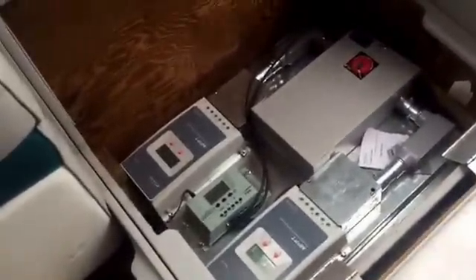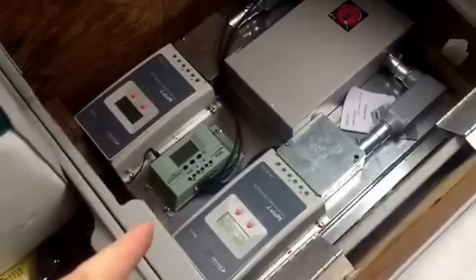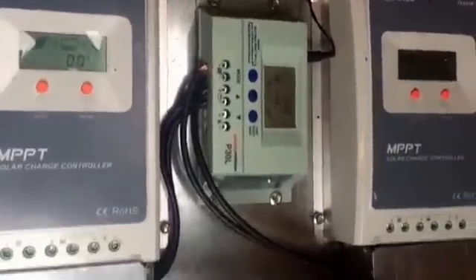We cleaned all that up. All the DC is now up front, run down properly. The DC circuitry is definitely back in line. Kevin and I had to figure out how to fit a roughly two-foot by two-foot double 40-amp OTG board from Hurricane Wind Power into this compartment, and then we retrofitted the Windy Nation charge controller over to it.